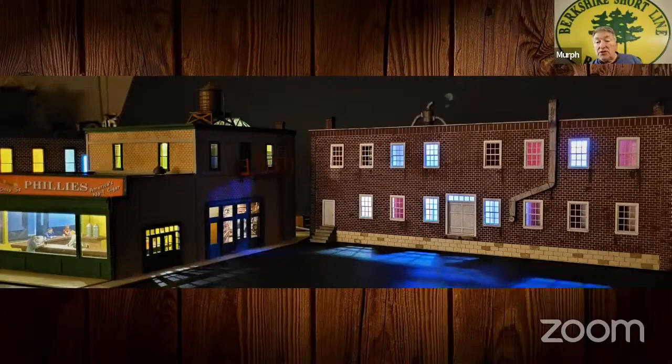You program it with a little simple array in your Arduino. Plug it in, and then it's trial and error. You change the program. So you can essentially build a tiny little color TV into each one of these little NeoPixels. How long it stays on and how bright is relatively easy to program. And you can do a whole town. I think you can have up to 50 of these pixels on one little Arduino Trinket the size of a postage stamp.